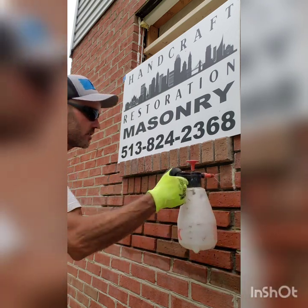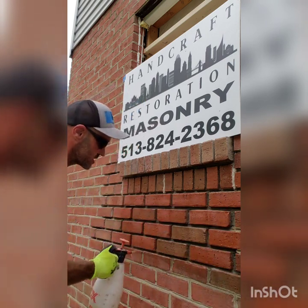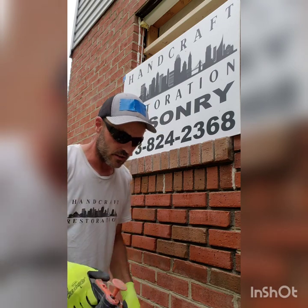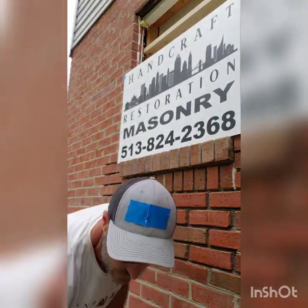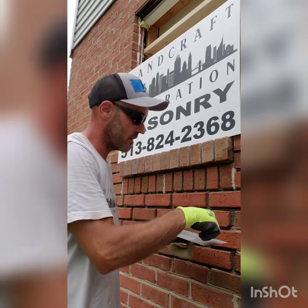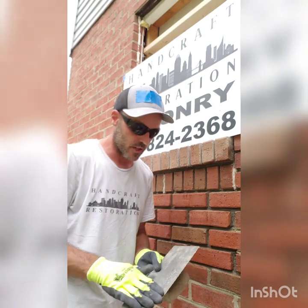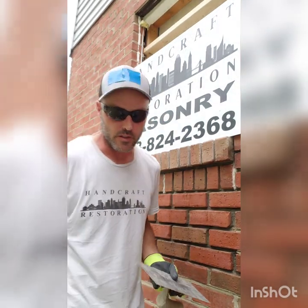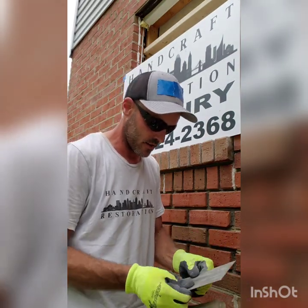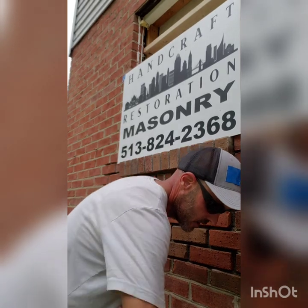I want to make sure the water gets in the joints. When I cut these things back yesterday I made sure it was about three-quarters of an inch — that's a good number. When you go to tuck point, some people say you have to do this in lifts — putting in one layer, letting it set, coming back with another layer, letting that set, and putting in a third layer, so three one-quarter inch lifts. That basically means you have to do the same job three times. I find that completely unnecessary. I get the theory behind it, but it's just not for me.